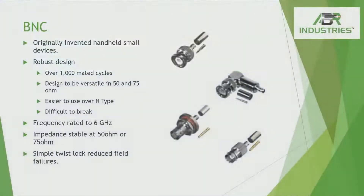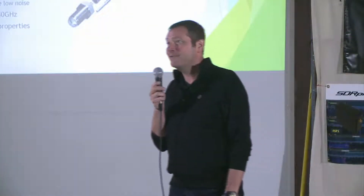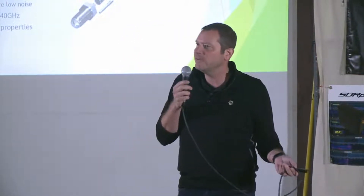The BNC is another product — very precise as well. It's a great product, but just not utilized as often. BNCs are used a lot in the 75-ohm world, so a lot of the 400 Flex we sell into broadcasting goes with BNCs on it because it is a precise connector. The last one that you're starting to see pop up more is the SMA. The SMA for years was not utilized as much as it is today, but it's a great little connector — very precise and very helpful for your applications. It can be difficult to utilize on a 400 though, as it becomes a little wobbly. You have more of a physical effect with an SMA on a 400 versus an SMA on a 195 or a 240-size cable.